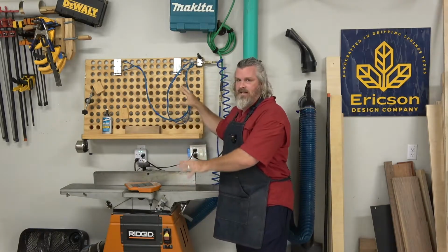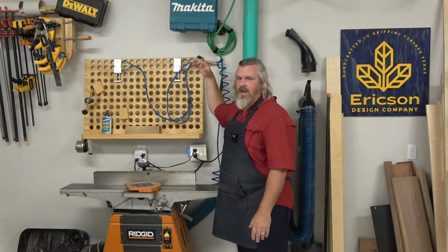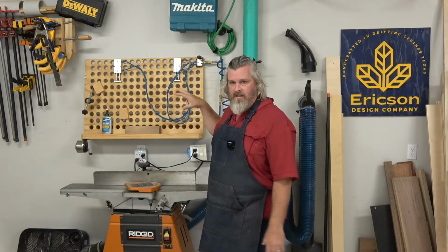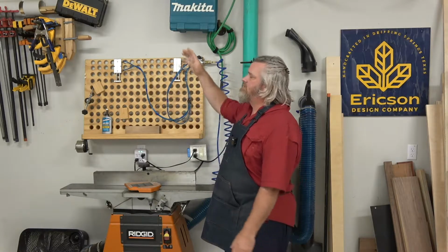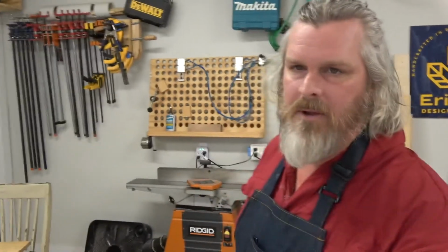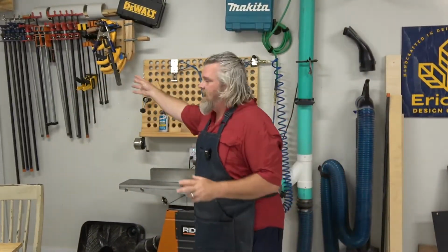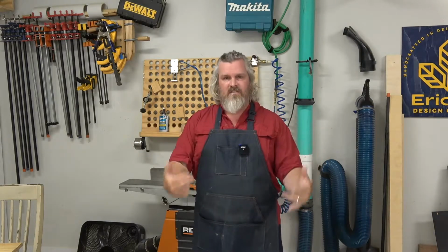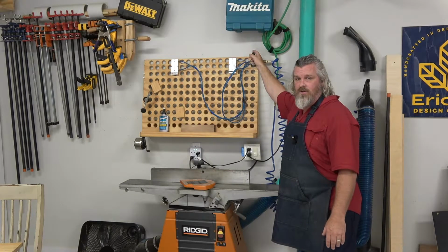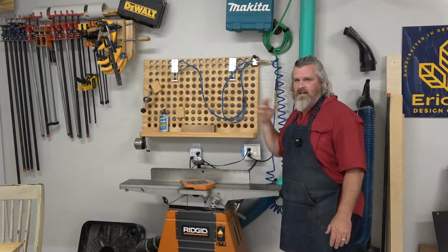And then I can set this up, hit my button, it clamps it down. I can go about doing other things, and that way I'm not charging while this is holding a clamp versus pulling off all of my big bar clamps, setting them up, gluing them up, you know what I mean? Taking the time to set up and glue up every individual cabinet door is not cost effective in the long run. So having this Ritter board to make cabinet doors, it's freaking awesome. That's a way that I can streamline and pass that savings down along to my customer.